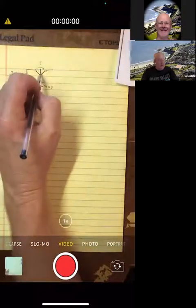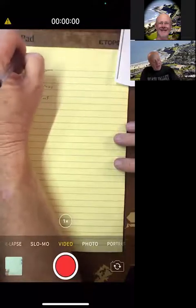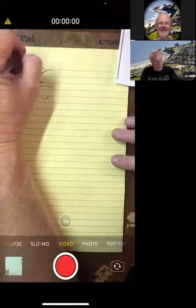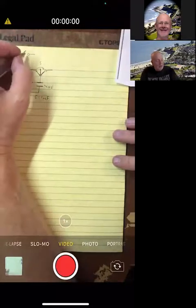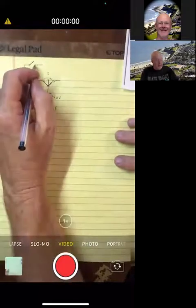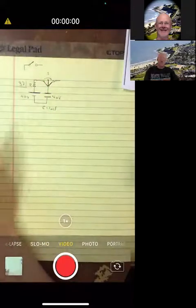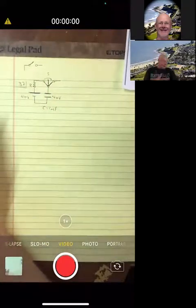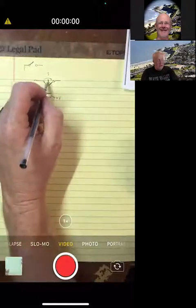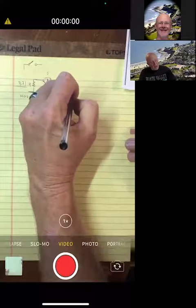And now you can see why it's a single pole double throw switch, whereas a lot of the switches I've been talking about look like this, kind of like a light switch. You just have a single pole and a single throw. It just makes a connection or doesn't. And so the switch is either on or the switch is off. It's the easiest type of switch. It's a single pole, single throw. But this is a single pole double throw. And so we throw it this way. And so I think they're saying here, now hook this to an inductor.